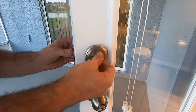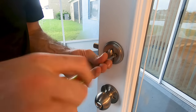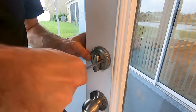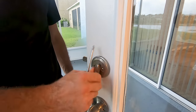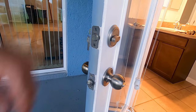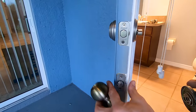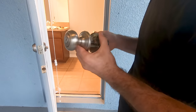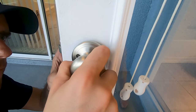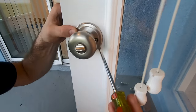Start the latch through there and line it up. Make sure it's going to turn. Put your screws in the deadbolt. Now this piece just twists into place — after you line it up, twist it up, then twist them down. It comes right through the openings, and then go ahead and tighten them up.